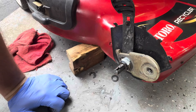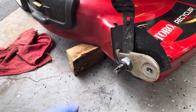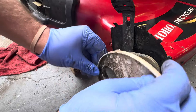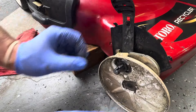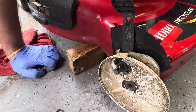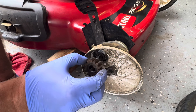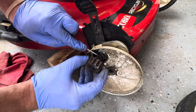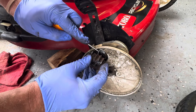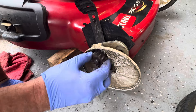When I'm putting this back together, I got to make sure that this goes on first, otherwise you won't be able to get it on afterwards. When you're putting this on, you can make it so that this can roll forward but not backwards, so I got to spin it this way. Then I got to hold the key down and get the gear over the top — there it spins forward, not backwards.